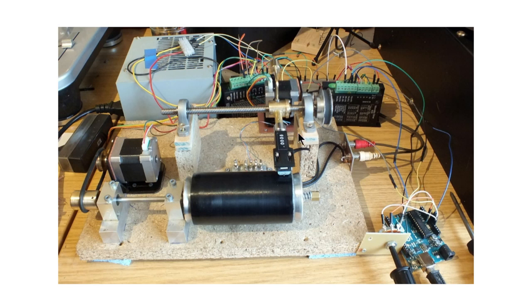And the easiest thing to do is to get one of these CNC computer or 3D printer screws, which I think are three start or even four start. We could do with a single start, actually, but it does work. And you can buy these pillow blocks and a long length of this and the rider for not very expensive. So really, this was a very, very rough lash-up. Okay, so what happened then?